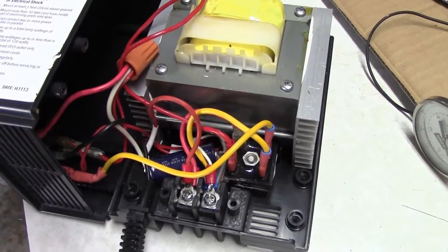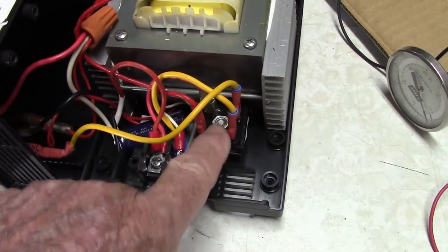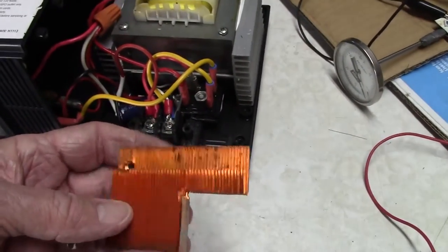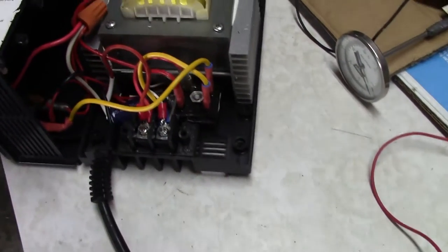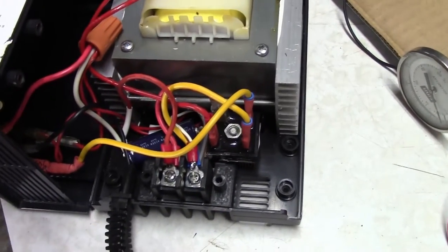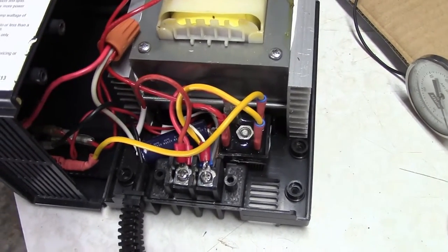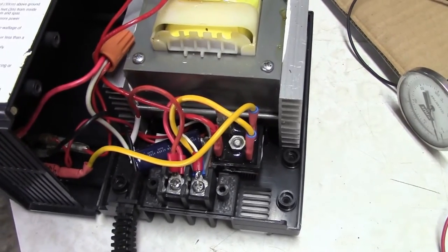So you have to take that into consideration when wiring your LEDs. Underneath the full-wave rectifier, which handles all the current, I took a piece of copper — this is a copper heat sink — and cut a corner out of it about the size of this full-wave rectifier. I put it underneath just in case I was drawing as much as 10 amps, because that thing will heat up pretty good. I also put some heat sink paste on it to conduct the heat away from the device.